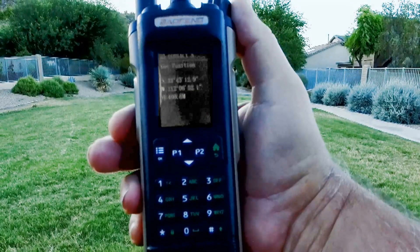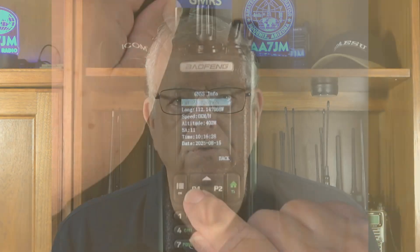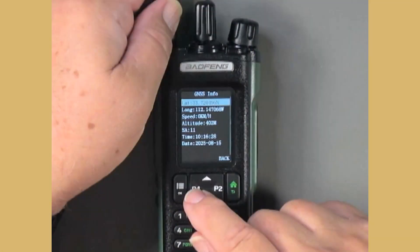Earlier I mentioned that the GPS systems in the two radios were different. In the UV-32, the radio will display your position and use an ANI device code to transmit and request GPS position from others set to the same group and frequency. The DM-32 also displays its GPS information, but uses digital APRS to beacon out its position via an APRS-dedicated talk group that passes information on to websites such as APRS.fi. As far as I've been able to tell, sharing GPS data between members of a group as with the UV-32 isn't possible on the DM-32 — leave a comment below if you've figured that out.